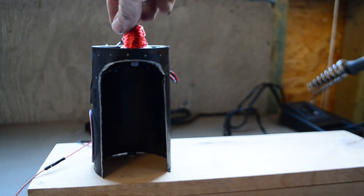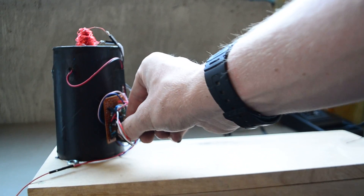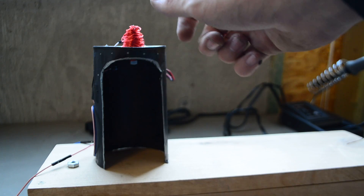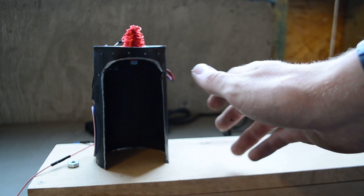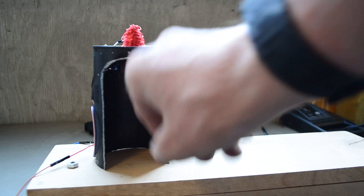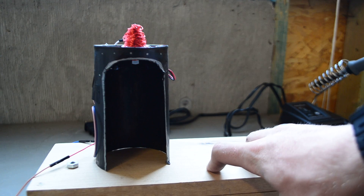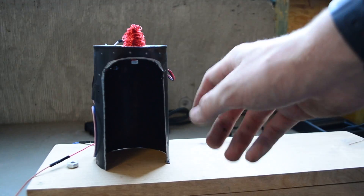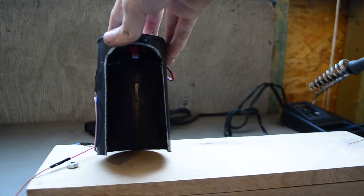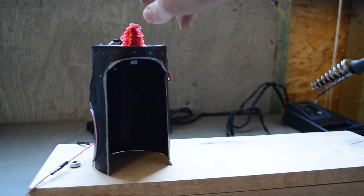A few notes about this thing. After leaving it running for about five minutes, this coil is pretty hot. The circuitry on the back is pretty much fine, except the MOSFET could probably use a heatsink, but it's not nearly as hot as the coil. Again, that problem would likely be solved if you used a better electromagnet — especially the half microwave oven transformer I mentioned earlier. If you do go that route, instead of the MOSFET I used, use something like an IRFP-260N, because those MOSFETs can handle quite a bit more current. Second, if you guys build this and when you put stuff in it just vibrates up and down, that means you should probably change the value of the capacitor. I originally used a 4.7 microfarad capacitor, but I changed it to a 2.2 microfarad capacitor because it was more stable. Depending on your situation, it'll probably range anywhere from around 2.2 microfarads to a maximum of 20 microfarads. This thing is pretty weak overall — it's more of just a little desktop toy. But it is a good proof of concept, and I am going to make quite a bigger one in the future.